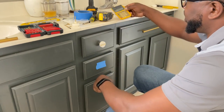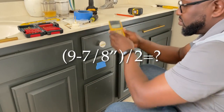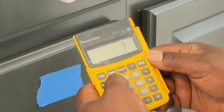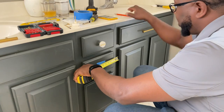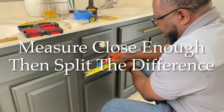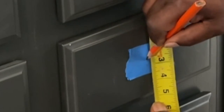The calculator allows you to measure in inches and feet so you don't rack your brain doing fractions. The width of this drawer is nine and seven-eighths. Nine and seven-eighths divided by two equals four and fifteen-sixteenths — we'll just call it five. So we make a mark at five on both sides. For the height it's five and a quarter, so half of that is two and five-eighths.